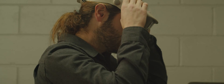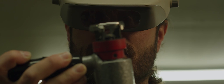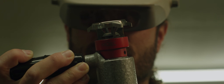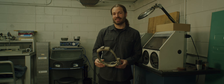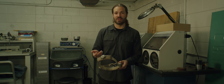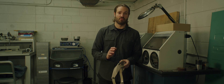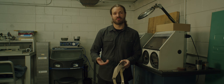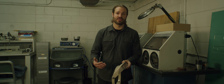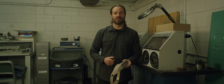There's also magnification attached to headgear that you can wear as a headband. It's two lenses, so you use both of your eyes, and this would be for larger components that you're inspecting, possibly while polishing. It allows you to be much further from the work and to use both eyes, which is very important for depth. You can also change the magnification by switching out the lenses. These aren't often used in watchmaking, but you will see them used by engravers, polishers, and sometimes machinists making parts. The main benefit is improved working distance for normal posture while manipulating or polishing a part, or doing engraving.